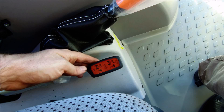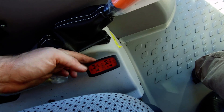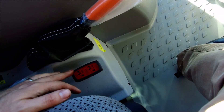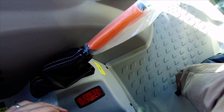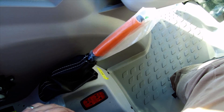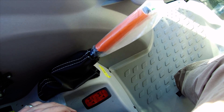We also have our four-wheel drive which is in and out. The four-wheel drive also has a front and rear diff lock when we hit the diff lock pedal. A safety feature which not many other tractors have is four-wheel wet disc independent brakes, which will give superb stopping power on any terrain.